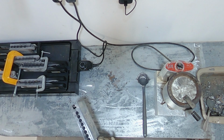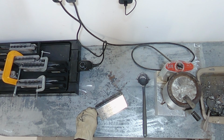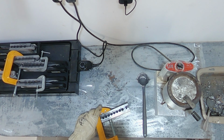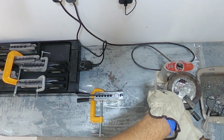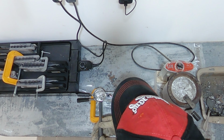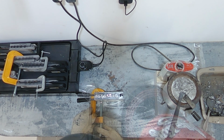You can start out with our first mold, which is a 1/8 to 1 ounce concave worm weight mold made by Collins Customs. We'll just put a quick clamp on it just to hold everything together. Now, I do have a bottom pour pot, but for today's video, we are going to hand ladle everything just to show you the different ways. Dip it, to heat up our ladle a little bit. And we'll move on to our next one.